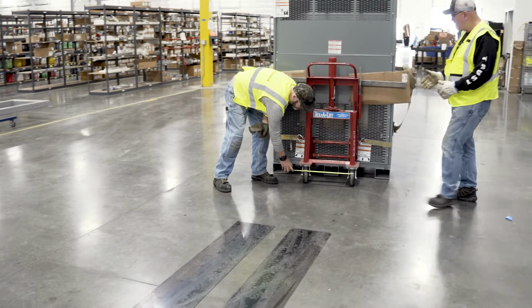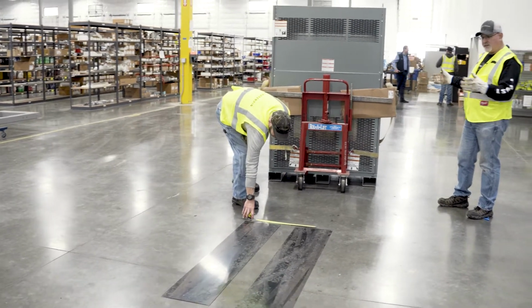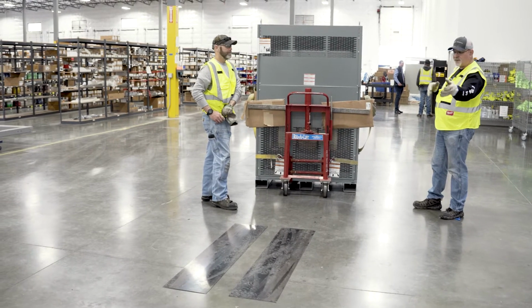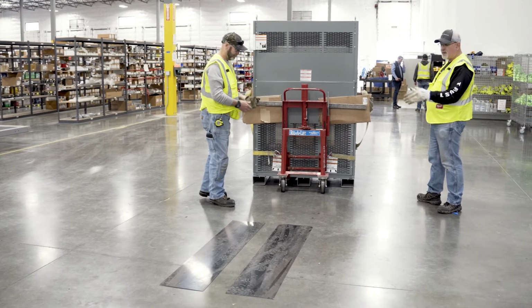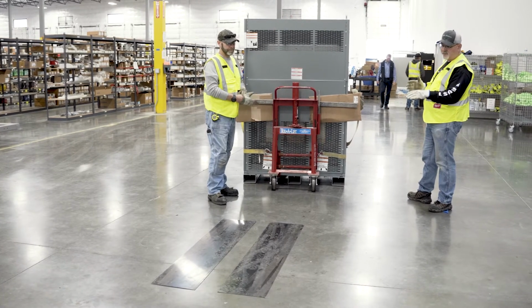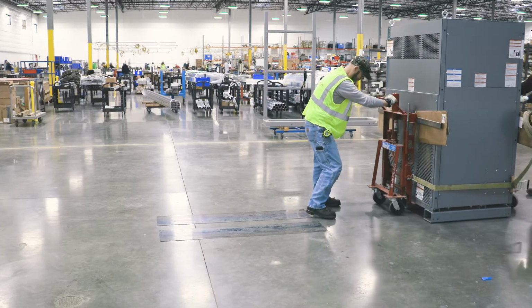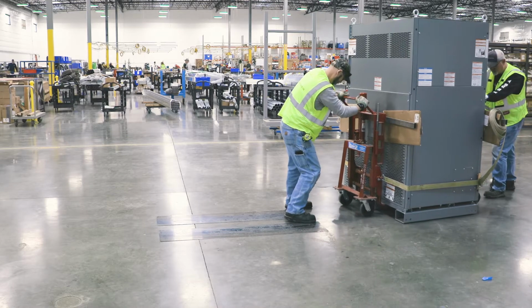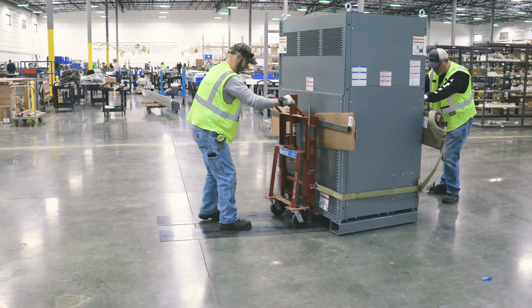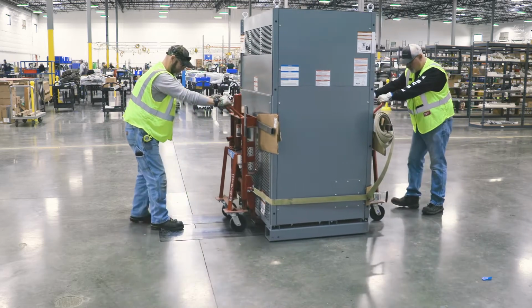In this example of moving into a freight elevator, steel transition plates are required since the wheels of the roller lift will cross the threshold while carrying the load. It is not possible to jump skate the load as we saw with the pallet jack. Place the transition plates in line with the casters and approach them at an angle so the casters hit the plate one at a time, thus reducing the amount of effort required to roll up onto the plate.